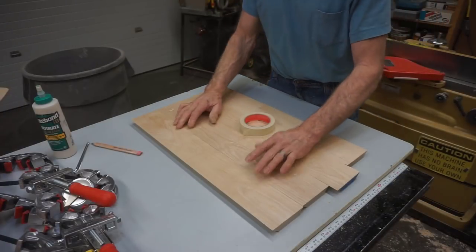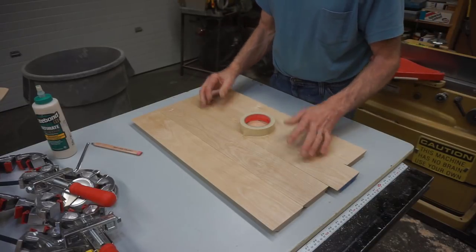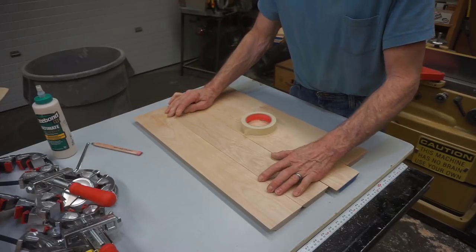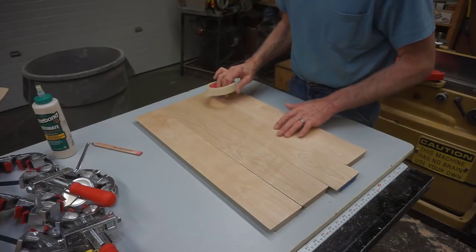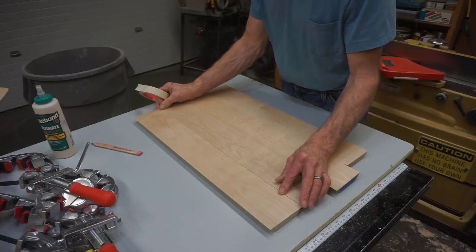The clamps are great for holding this together, but getting it all set up and glued so that I can put the clamps on can be pretty unwieldy. On the making-round-cylinders video where I was gluing up hexagons, I used biscuit joints in every miter to help line things up, but for these posts I've only got four sides and I don't want to put in all those biscuits. The glue joint will be more than strong enough once I get it set up.